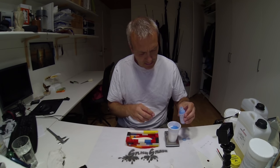Apart from that, I've transferred the two marks from the master to the mold to see where the weight should be positioned, and then using some thinner wire that is much easier to bend, I can then position the weight within the body according to the marks and as low in the body as possible.